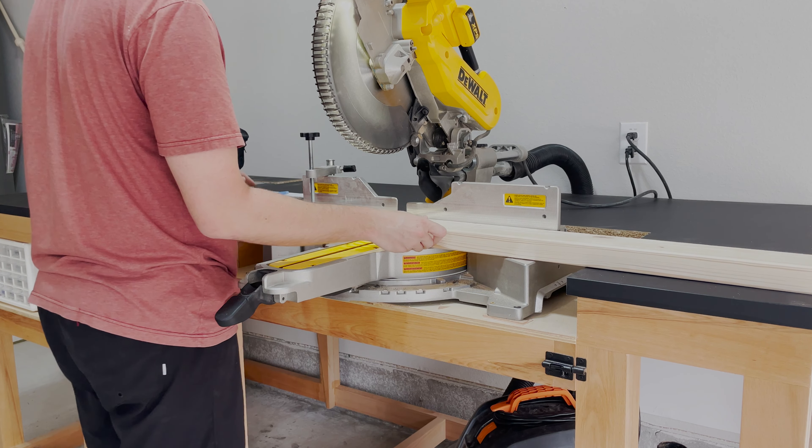After making the fourth cut, take the legs you just cut and place one in the corner. Using a 3-inch long hinge kit — it comes with three-quarter-inch long screws and one long screw — make sure you're using the three-quarter-inch screws and not one-inch, otherwise they'll go through the plywood and stick out the top. Put the long screw into the wood leg itself, test that it folds properly, then move on to the hinge supports, screwing them into the interior side of the leg. The screws that come with it are about half-inch long.